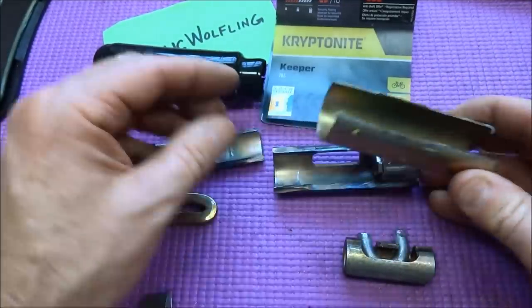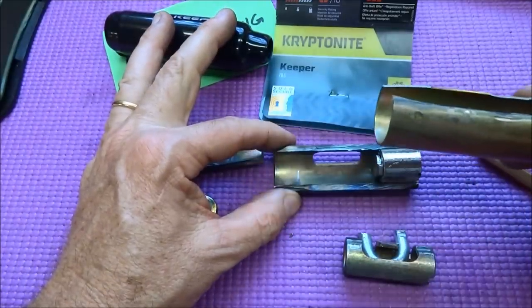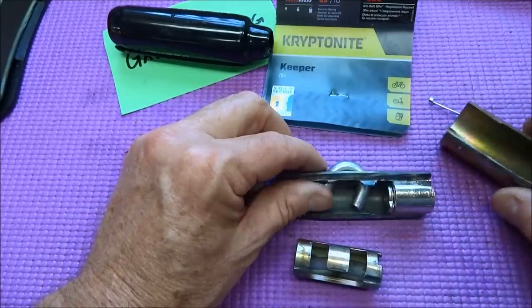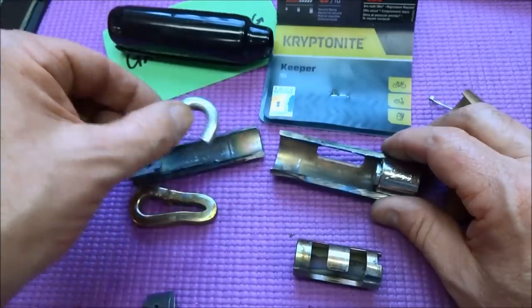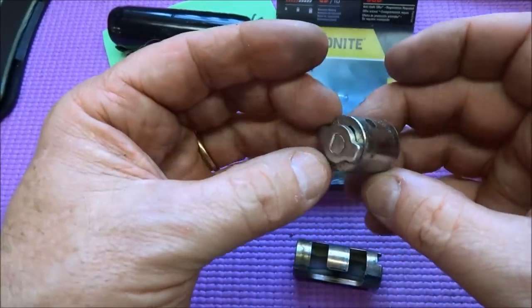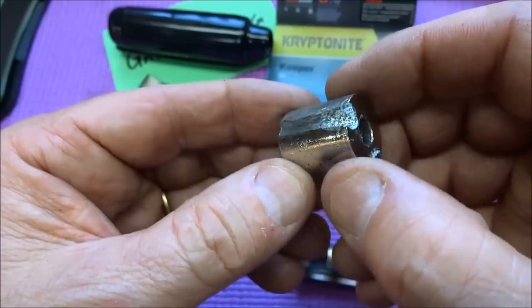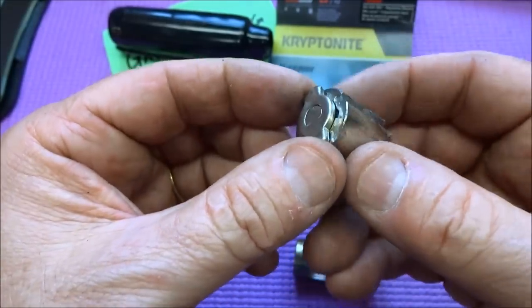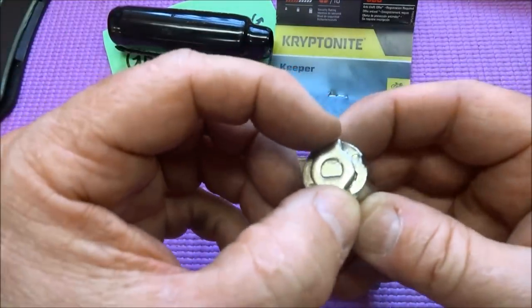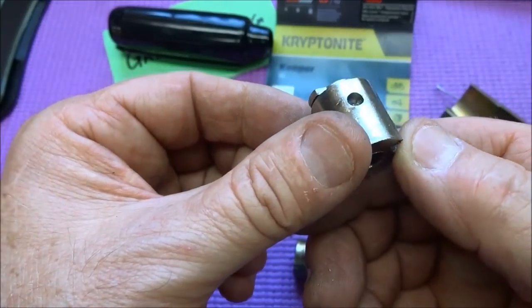If the chain had been locked in here, even if we had pushed the pin out, we would not have been able to remove the outer sleeve because the link would have protruded through the hole and prevented the sleeve from coming off. We're just doing an autopsy at this point. When I finally get the lock itself out — the part we've so desperately tried to access — it's still inside a basically armored steel container, and this plugs directly into the back of the actuator.